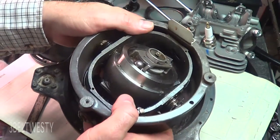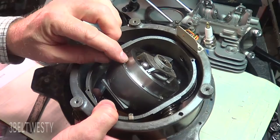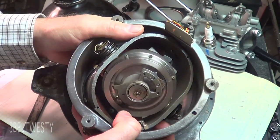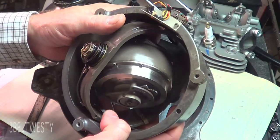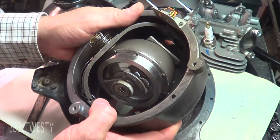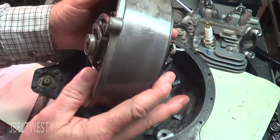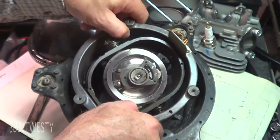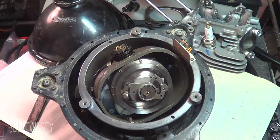What you do on something like this, one that's been under salt water, you just undo screws, you scrub it with a toothbrush, put oil on it, spray it down, go back and forth again, and you can finally get something free. But this literally was a corroded mess, and I've got a fairly decent looking one.